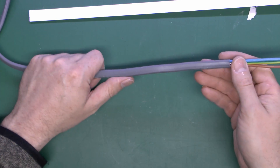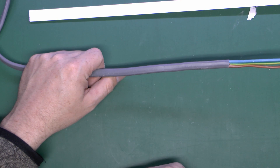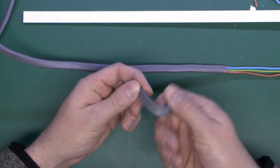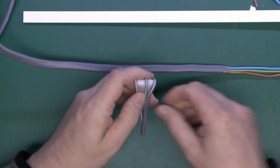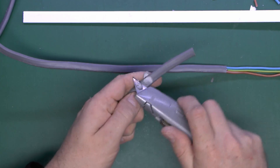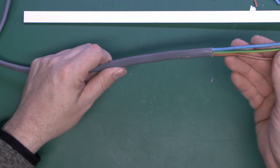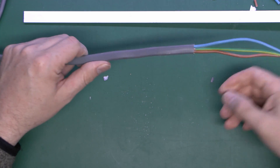Twin-and-earth is also not suitable for underground use, as there's no protection — a spade will go straight through it. The outer covering is fairly soft and flexible, and even a moderately sharp object can cause significant damage to the surface quite quickly. It's not suitable outside, but for internal wiring it's pretty much the standard for homes and smaller installations.